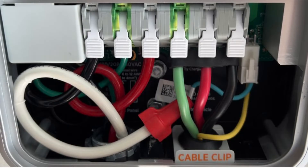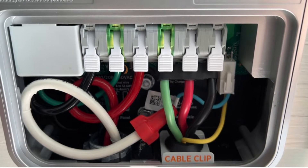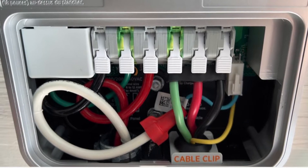Before touching any of the wires, test them again with a non-contact meter. On the left you can see you have your two hots and the ground in the middle. Next you have to connect the charge cable. There's a temperature sensor to the right, and then you plug in your two hots and ground. They're inside of a grommet so you can't get the order wrong.